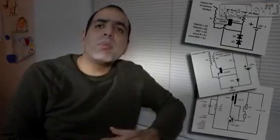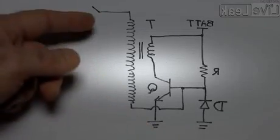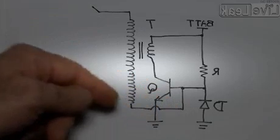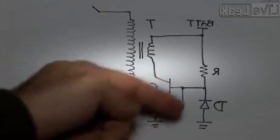This circuit is all over the web, and people make it sound like it actually works. But a quick analysis of the circuit shows that this circuit relies on the feedback from the secondary winding of the transformer. But the other end of the secondary is not connected anywhere — it's open circuit and can't affect the transistor.